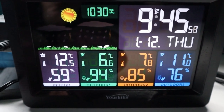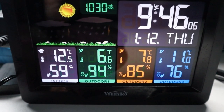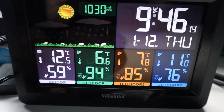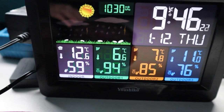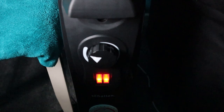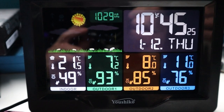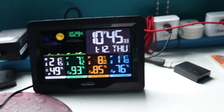This is a test of how quickly it will heat the room. The time is 9:46 and the shed is at 12.5 degrees — that's the white reading on the left. The green 6 degrees on the right is the outside temperature; 59 is the humidity inside. So 12.6 degrees at 9:46, and I'm now turning the heater on — 'Alexa, turn shed heater on.' We've now got it on full, approximately 2.5 kilowatts. Let's see how hot it gets in one hour.